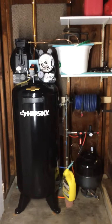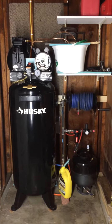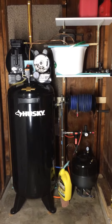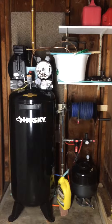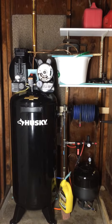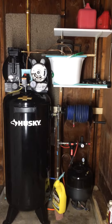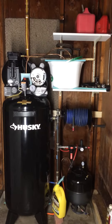I wanted to show the after-cooler idea I had — using an AC condenser from a car behind it for a few days, and a combination of that collection tank you see down on the lower right hand of the screen. I ended up with a bucket of coolant and water mix and about four or five inch loops, so it exits from the compressor head, loops around through the water, and it cools it down.